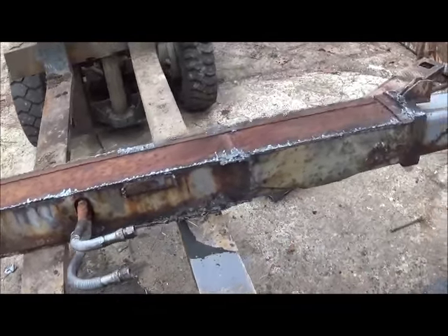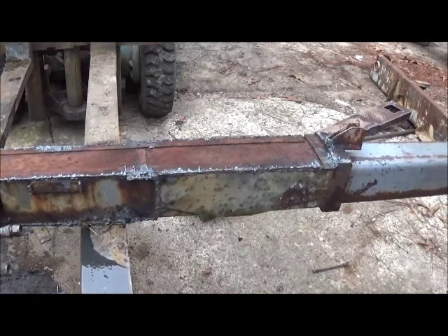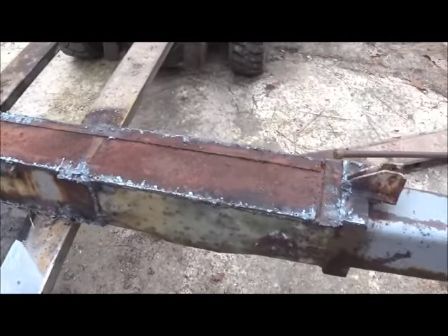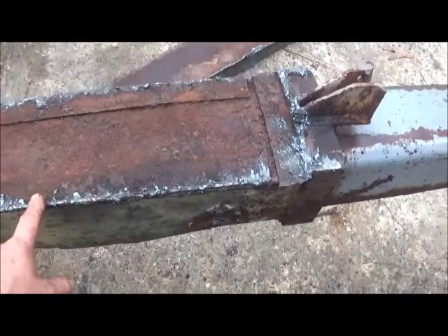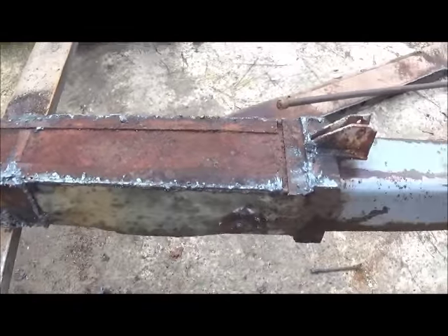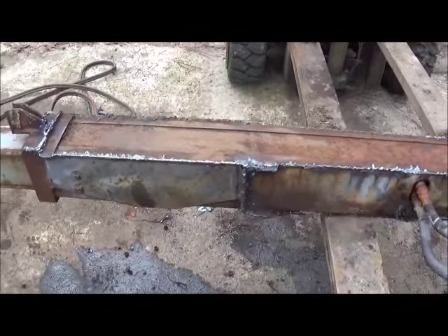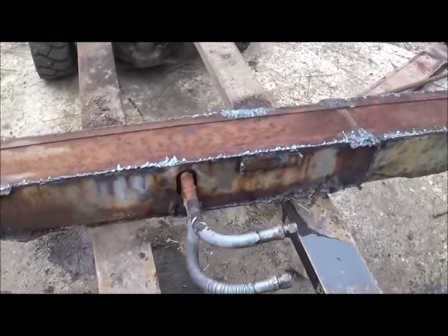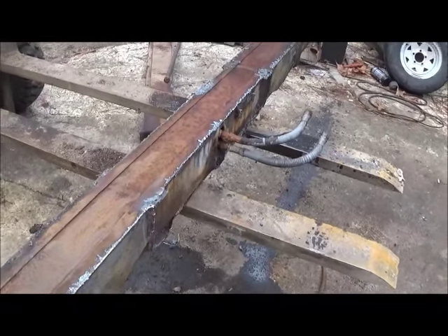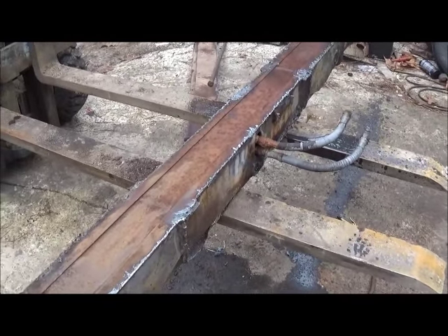The reason we're doing it on the back is that when we swing around the tail, we won't interfere with it - and we're not going to be swinging far enough to really get involved with this anyway since it'll be so far forward on the bed. I'm going to quit talking and get to cleaning up. These pieces are fully welded all the way down so it's going to take quite a bit to get them off - I'll probably just burn them off and go back and grind everything. Spend the day on something like this and when you're done, you've got a nice outrigger. This is not in bad shape - it looks a little rusty but nothing major. We'll slide it up under the truck just to see what she's going to look like.